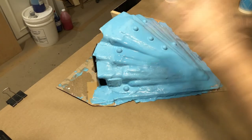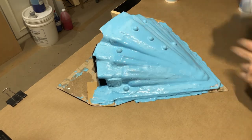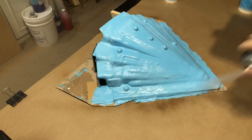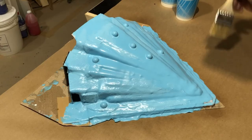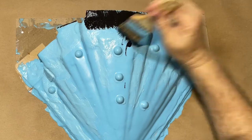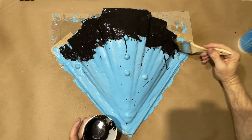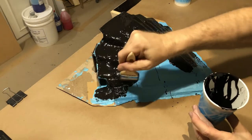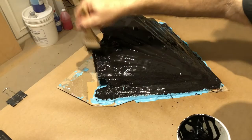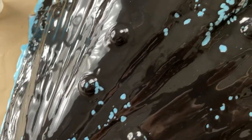We've got all the silicone work done on this side, built it all up, even put the little knobby bumpies in there — I made a short video on making those. Let's get some parting agent on and lay the gel coat on. I mixed up a 70-gram batch, which turned out to be just about what I needed, and you just brush it on — there's no magic to it. These spots you're looking at are where the resin pulled away from the rubber, and those are known as holidays.